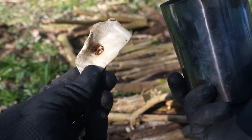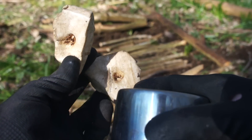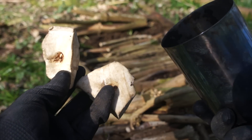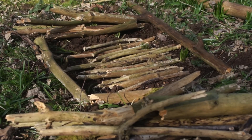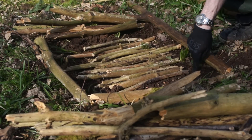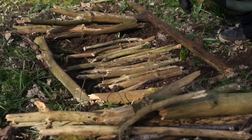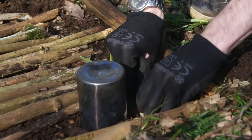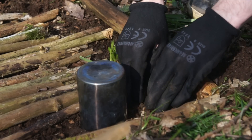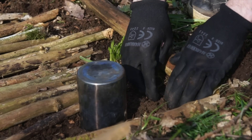I've created a small dent in each piece, just so you know it's legit and that I'm not swapping it out for a piece of charcoal. If you choose to go for the ground method, before you start your fire, make a nice little wooden perimeter for it — it will serve as a reference point to help you find where you buried your material. I bury my material right at the corner to make it easy to find again; it's very easy to lose it if you just wing it. Just cover it up with a fine layer of dirt to prevent it from being scorched if it comes into direct contact with embers, and most importantly, to prevent any oxygen from reaching it.